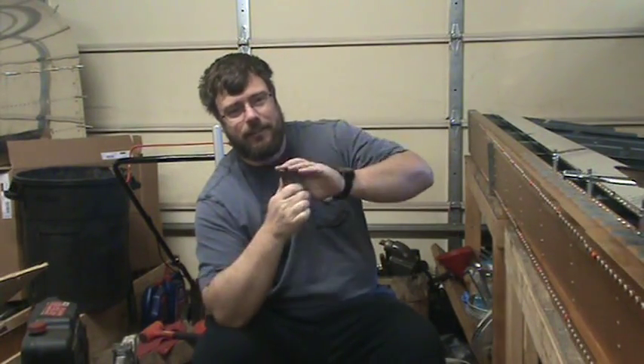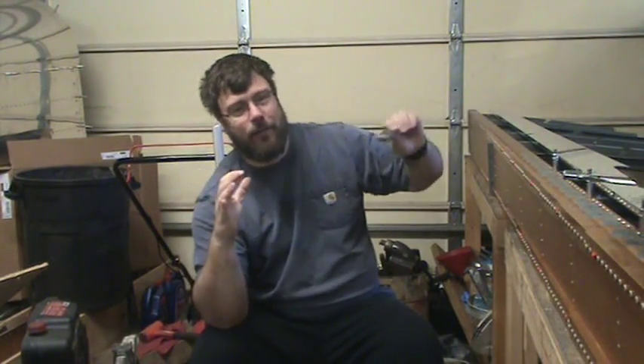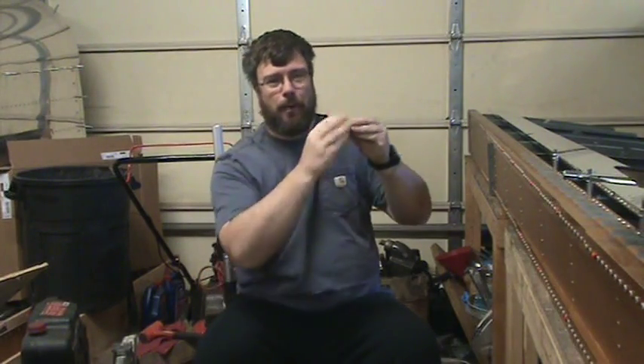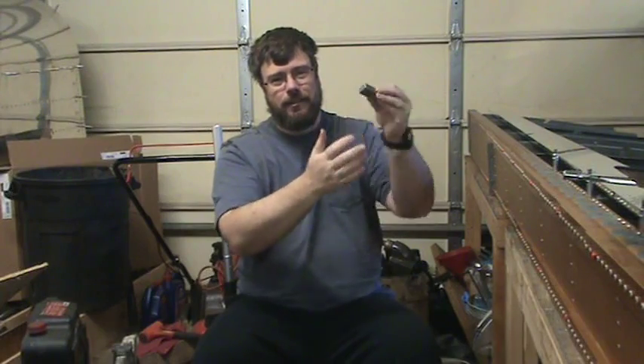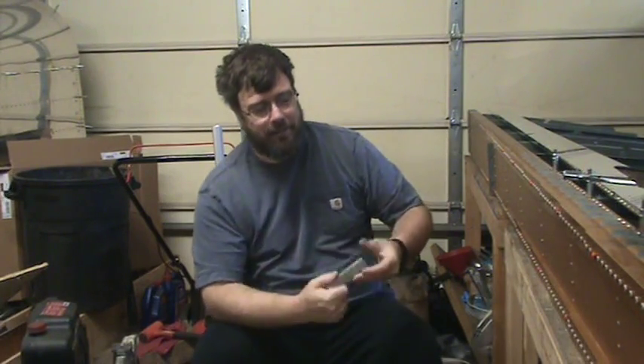This thing would normally be pretty light but it's made out of tungsten. It's going to set you back well over $100, but it's almost as if this one bar can eliminate a whole variety of steel bars you would normally have to get. Because steel is so much lighter, they have to be bigger bars, and because they're bigger you need a variety of them to fit into different spaces - like a bar that reduces down to something small to squeeze in, or one with an angle offset so you can still have the mass behind it.